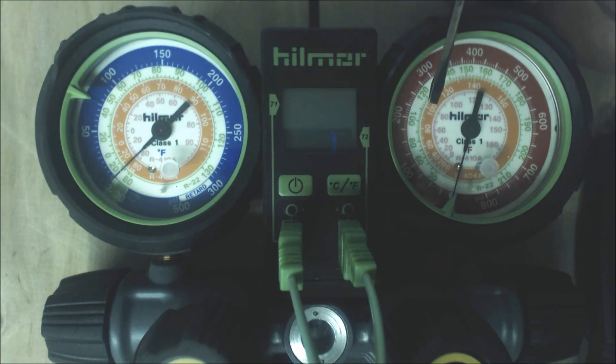The same thing would happen with R410A. Say it was 250 PSIG — you bring it in and it looks to be about 82 degrees for R410A on the liquid line, and you had 70 degrees on the liquid line — that would be a correct charge. But if your subcooling was too low, say 250 PSIG giving 82 degrees saturated temperature and you actually had 79 degrees, then you'd only have 3 degrees of actual subcooling and you'd need to add refrigerant.